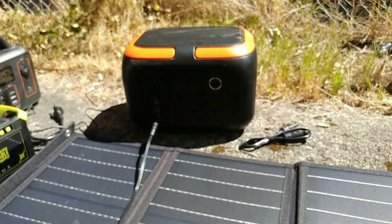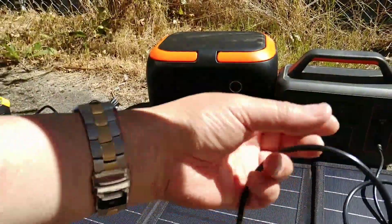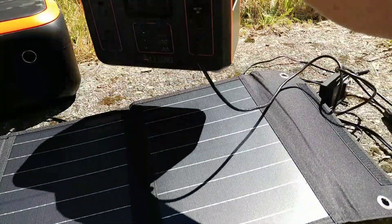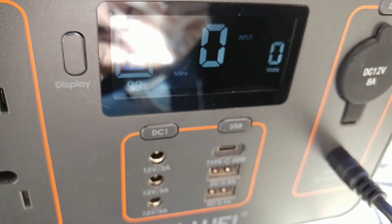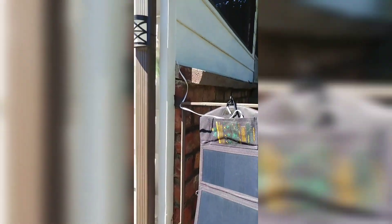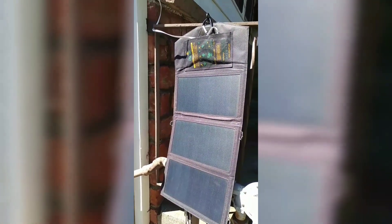See that? It's connected to the solar panel right there. Pan over here — it's connected to the solar panel. See it's charging? Even using a solar panel to charge my camera up there. It's battery operated — no electricity. Ran a wire all the way down USB and it's powered by the sun. If you're charging outside like this, make sure your battery is under the shade so it doesn't get too hot.